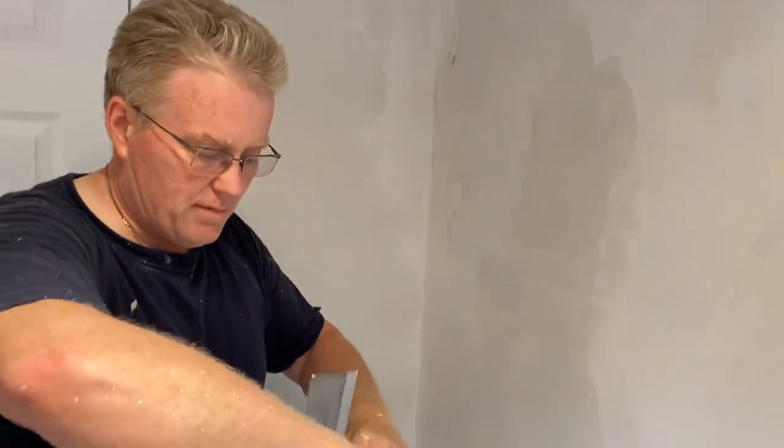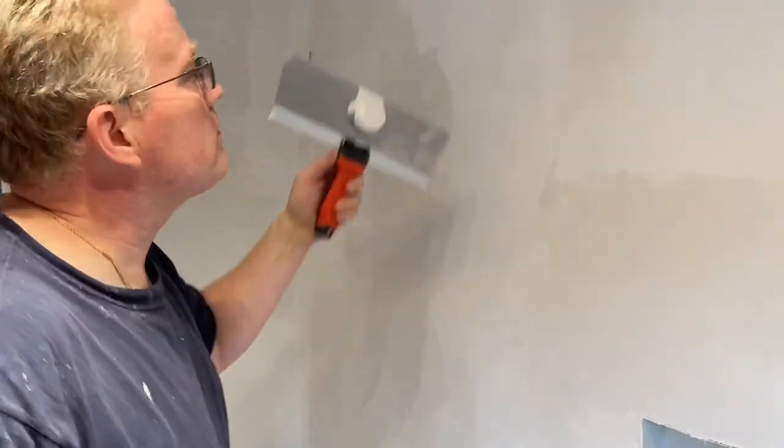The angle and consistency will give you the perfect amount on your wall. All you're looking to do is fill in the little tears in the paper — it takes an eighth of an inch, not even. So many people skim coat wrong — they go too thick. Watch the angle: 45 degrees. If you really want to advance your skim coat skills, take a sprayer — the one you spray flowers with, holds a quart of water — and just wet the wall. The more you wet it, the easier it is to drag off the wall. If it's too tight, it works terribly on your muscles and it's hard to pull off.